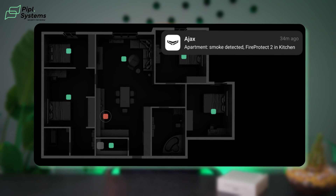Another nice functionality of the FireProtect 2 is that you can interconnect multiple units to the whole solution. If you have a big facility covering many areas and there is a fire in a specific room, your FireProtect goes off, sends a signal to the hub, the hub sends signals to the other FireProtects and they all start buzzing. This indicates something is going on so people can exit the premises safely — when there is a fire, we need to act quickly.